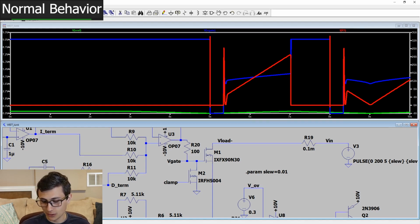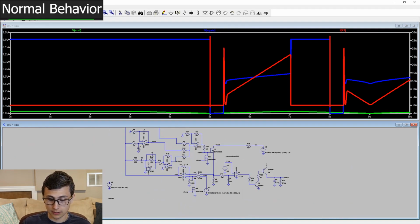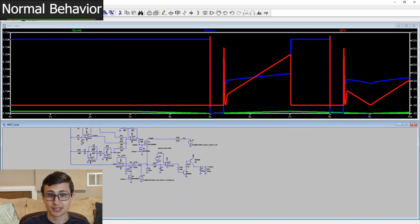There's a lot of nuances that we're going to need to cover, like making sure we're going to be stable with that much gate capacitance hanging off the final amplifier, making sure we've got good transient response. Oh, it's going to be good. There's going to be a lot of good engineering design that's going to go into our electronic load. I'm hoping that we can get some high precision. I want some high accuracy electronics going on. I want to get a precision current source going.